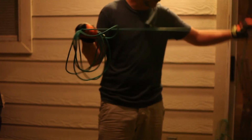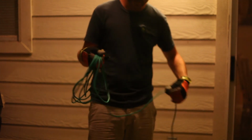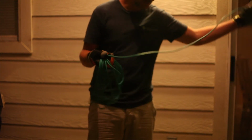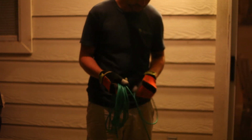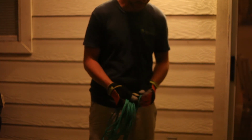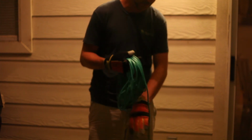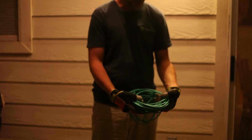And so it looks like this cable hasn't always been wrapped that way, so it's going to have some funny little twists. But if you wrap your cable like this consistently from when you purchase it, it's always going to throw out straight, and it's just going to be a lot easier to manage. This isn't the only way to do it. I've also worked in live sound where you use one of those cable spindles where you just roll it up and you can link together the XLRs, and depending on lengths, you can have multiple XLR cables on one of those spindles. But this is the over-under approach for cable wrapping, and then I'm gonna clip it with one of those orange clippy thingies.